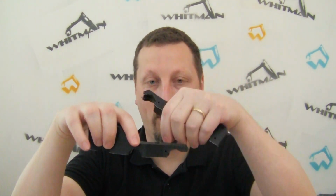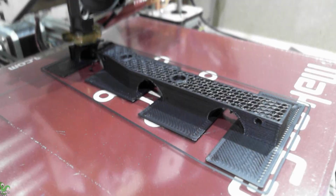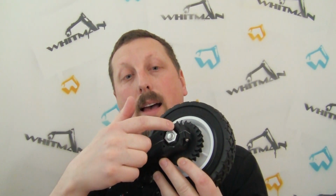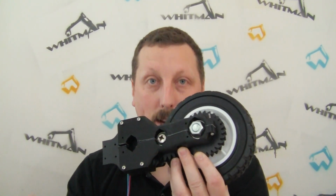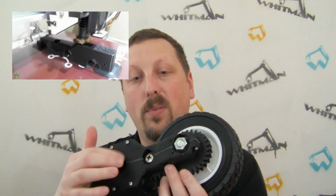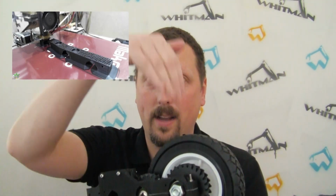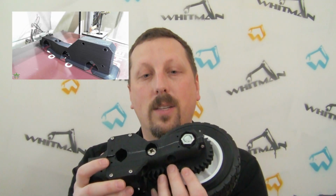There's nothing underneath it to print against. And that can be really messy, and I found that really affected the integrity of the inner diameters. When I did that redesign to make the diameters larger, I put a little teardrop shape at the top. That teardrop shape allows a smooth kind of roof line that the printer can print at that angle very well. So it ended up printing out very cleanly through those parts that go over the open air. And I didn't have to do any filing at all on this when it was done.